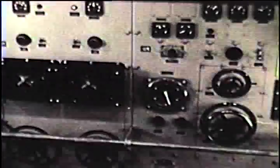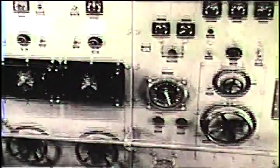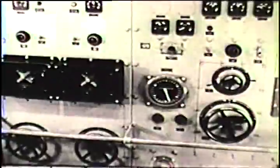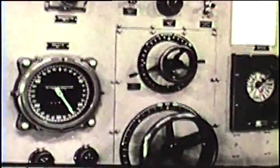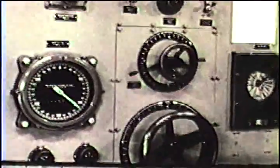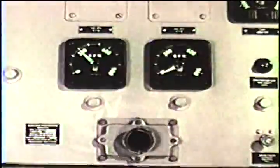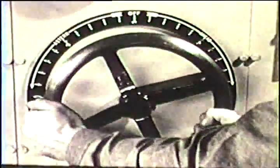Engine fails. If the engine fails when using only one generator and one engine for propulsion, the engine fault relay will not operate. At the control board, the first visible sign of trouble is a drop in shaft RPM. The dropping engine revolutions show that the trouble is an engine failure.